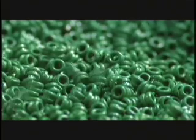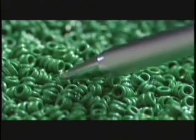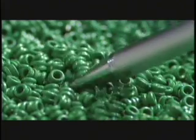Ball ends are placed in plastic hoppers which shake from the force of specially designed air pistons pushing up through the centers — this is the ball end sorter. Ball ends shoot out of the pistons into a bucket underneath in preparation for attachment to the core.